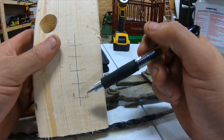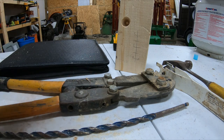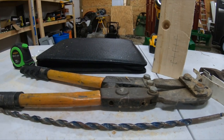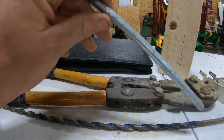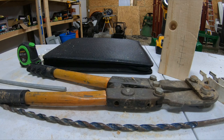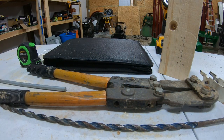You can steeple these as you're running them. The first thing you're going to need is your tape line, like I said, to get your spacing of your wire. I'll link some stuff below in the video for you guys to look at. I do like that branded tape line — they've lasted pretty well on the farm. The second thing you're going to need is a hammer of any type or kind. The hammer is going to be used to drive your steeples, your brace pins, your brace post or corner posts. You can also put your wire in there and give it a pull or hold it.